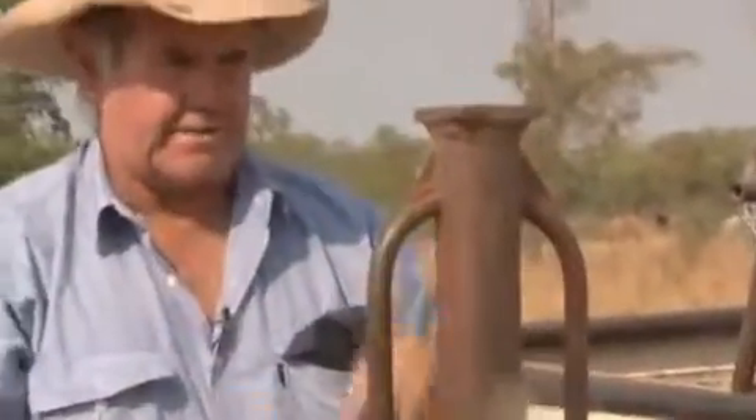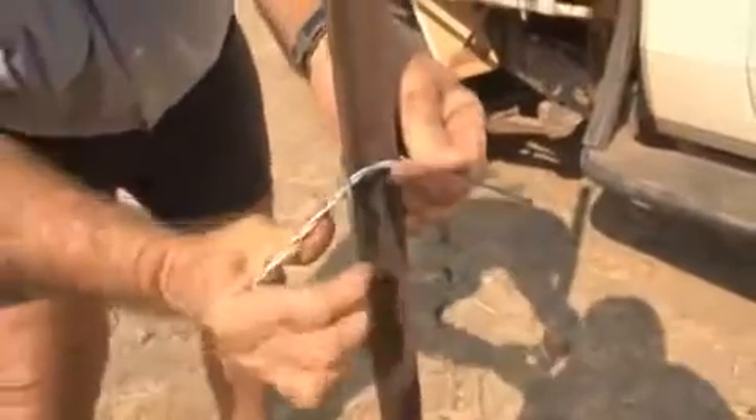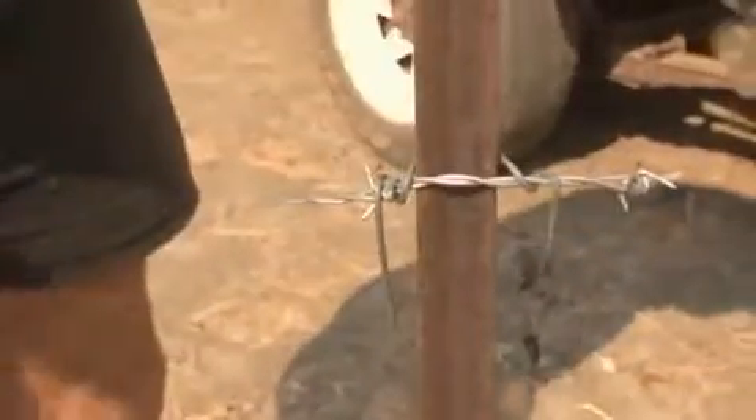Most of these things are designed for the right height. When that hits the ground, that's the height of the picket. These are the little bits of wire that you put through the picket like that. Put it on there and then you wrap this around the wire like that. Always leave the tie hanging down so the cattle can't get hit with it. Same thing on the other side. As long as this is a full piece of wire — this is just a bit of an exhibition — that's how you tie a tie on.